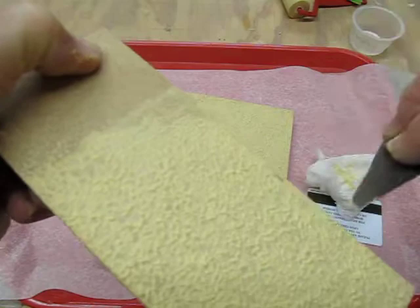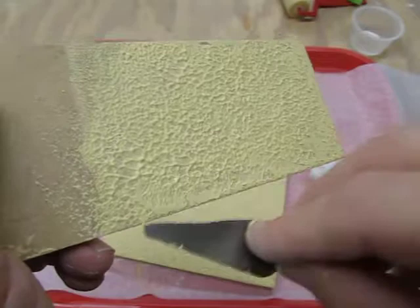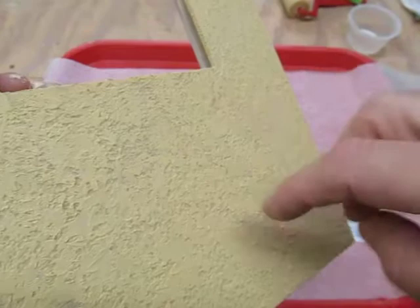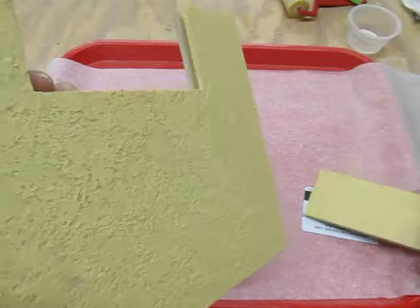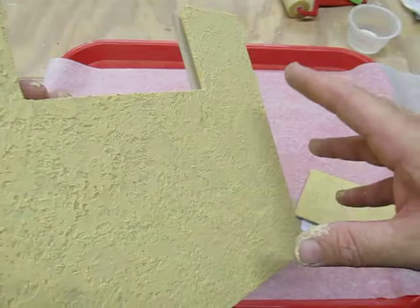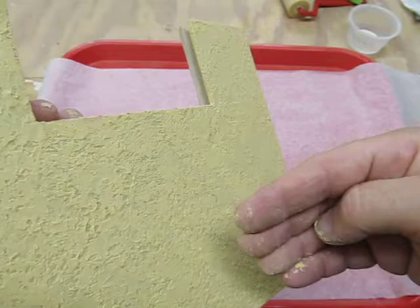The smaller the piece, the faster it's going to dry. This sample has a different texture — I used the finer sponge on this one. It's quite cool and humid today, so it's probably going to take a little longer than average to dry. I came back in five-minute intervals, checked, did other things in the workshop, and came back and finished. You can see it's got a smoother texture because of the smoother sponge; I also troweled it a bit more. These little loose crumbs of filler — don't worry about them; when it's totally dry and you sand, they'll be knocked off. You can vary the amount of texture you leave with the sanding. This is not the finished texture, so you're not trying for perfection — you still have sanding to go. It's also additive: you can always come back once it's totally dry, add a little filler where you need it, and retexture.